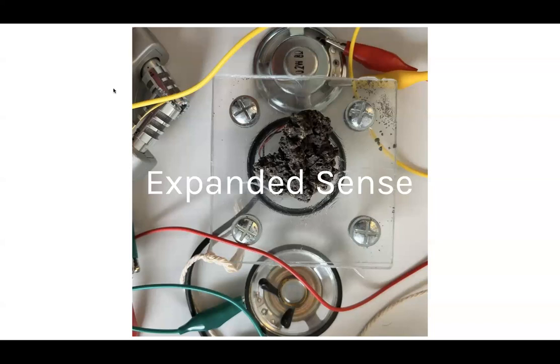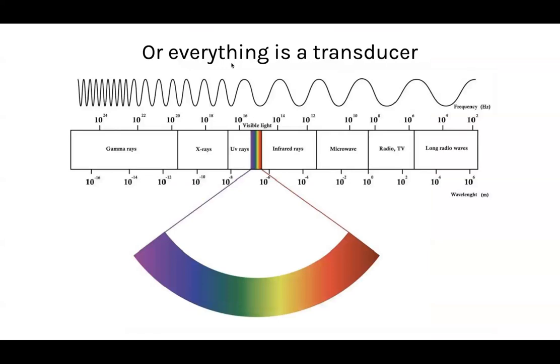The structure of what we will do today is we will realize that pretty much anything can be used as a transducer. We can use anything to convert energy from one realm into another. And this is really exciting. We can even take technology that is used for specific things and just reverse it. A really good example of this is taking a pair of headphones and reversing that circuit by putting a jack plug on those, plugging it into an amplifier and turning it into a lo-fi microphone. So we're really going to play around with experimenting with what objects we have in our houses, obviously the components that we've brought, and what we can do with these objects to make interesting sounds and reveal different areas of vibration.